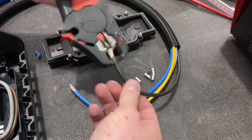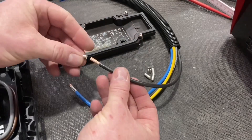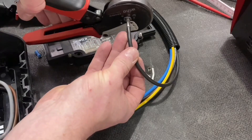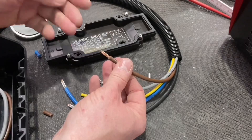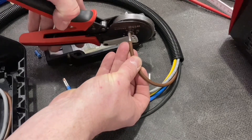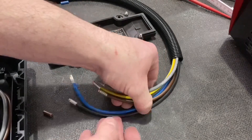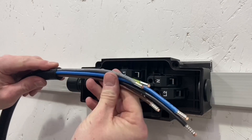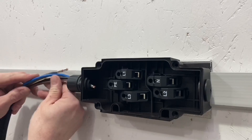What a beautiful system - you can do it off-site on a nice warm bench, build them all up. You're not using ferrules with the plastic ends on, Gary - why is that? It just makes it a little bit easier to insert into the final connecting position without the little shields on them - also you're passing them through the gland. So just ferrule these up and then we'll be ready to take that to site. Our bundle's ready - both ends done.